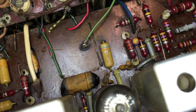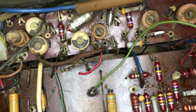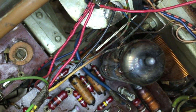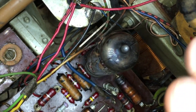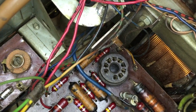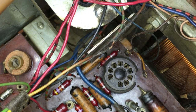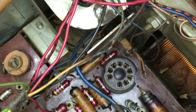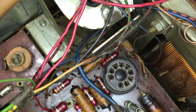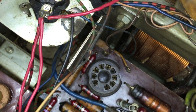I've seen other signs of heat damage as well — there's another one that's melting away down there. And when we look behind the EL84, you can actually see that the wires become bare over there. That's heat damage; the wires are all discoloured. Even after trying to clean them, I can see they're discoloured. And that particular one is actually melted away — although there's still continuity, it seems, the sleeving is completely melted away.